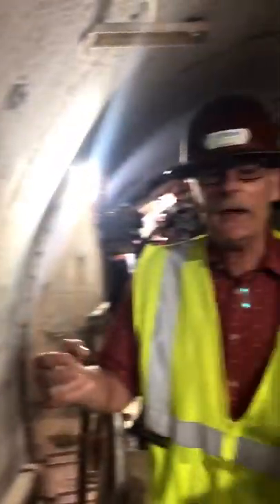I want to talk to everybody a little bit about the tunnel boring machine. Right here we've got bare rock that has been tunneled. It's dry rock, as you can see — a lot of dust from it. And this is what we refer to as our starter tunnel for the Fall Creek Tunnel. Behind me is the cutter head all the way up against the front face. It's the front of the cutter head that actually grinds the rock to break it down so we can dispose of it.